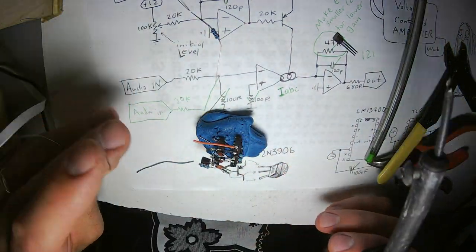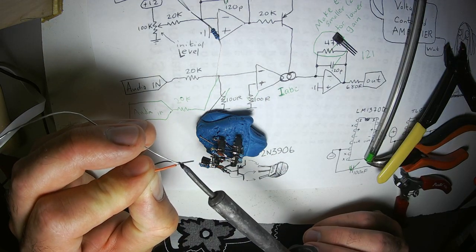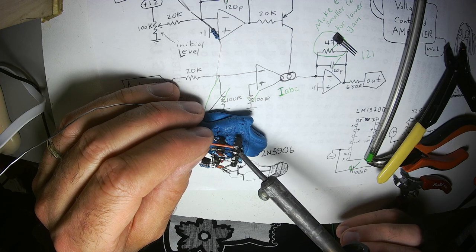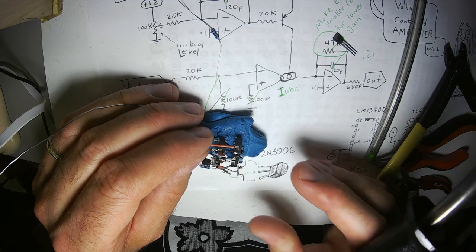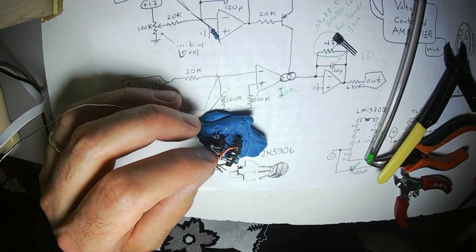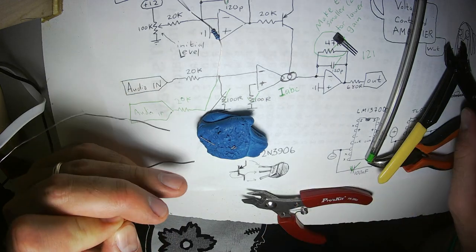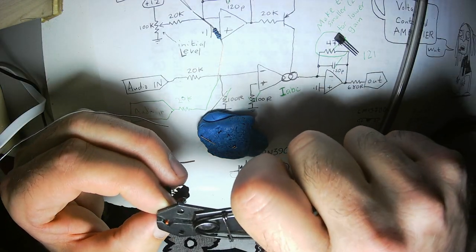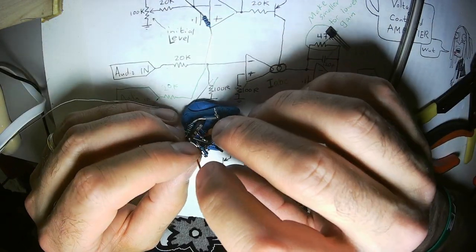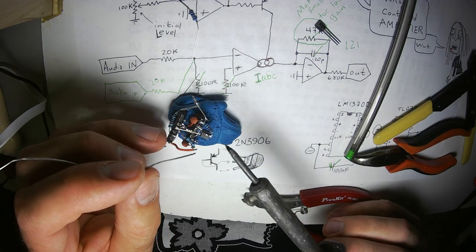Some wire is harder to solder to than others, harder to get wet. If you feel like having a little tub of flux sitting near your workstation, hey, great, go ahead and do that. Dip stubborn bits of work, whether it's transistor leads or wire that you don't know where it came from, and it might have been sitting in a warehouse, humid, hot, and might have corroded a little bit, might be hard to solder to. Hey, dip that wire into some flux that will magically make it so easy to solder to.